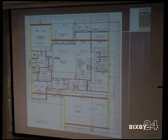You can try CSPF on an 8-foot plate height. A minimum of 16 inches is required. Well, I've got 16 inches. So I've got 16 and 16, that's 32 inches. Does that work? I needed 4.22 feet of bracing, so that doesn't work. That's when you would look at this section over here and see there wasn't 18 inches, there wasn't 16 inches, there's really nothing I could do at that corner to get a brace wall panel because it's less than 16 inches. So it's one that you can send my kids to college and put a steel strong wall there and there and there, and get all the bracing you need, but you just spent $1,000. You don't need to do that. So CSPF isn't really an option.